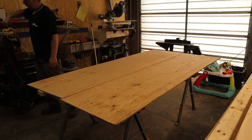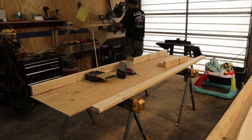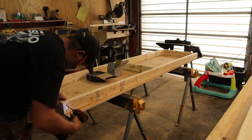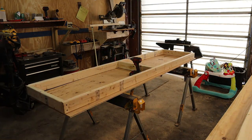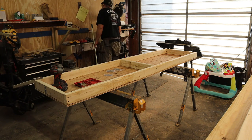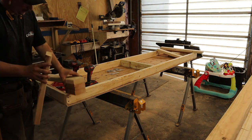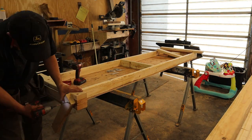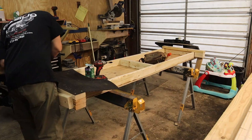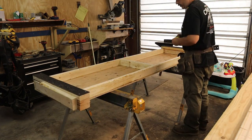When we got around to painting the east and west sides of the house, we weren't able to pull the basket up to the house like we did on the north and south sides because the roof is pitched. So Nick went ahead and built us a platform so we'd be able to stand safely next to the dormers. He used a piece of plywood with some framing to support it, and on the feet he put conveyor belt material which is really grippy. Against the roof shingles it held really well — I was not scared of slipping at all. It leveled things out and I felt a lot safer and more comfortable, not constantly having to catch my balance.